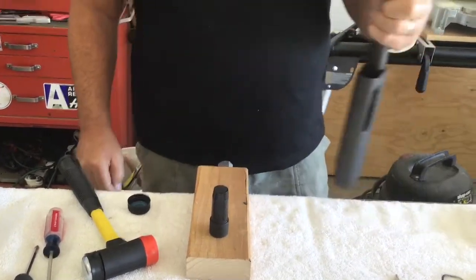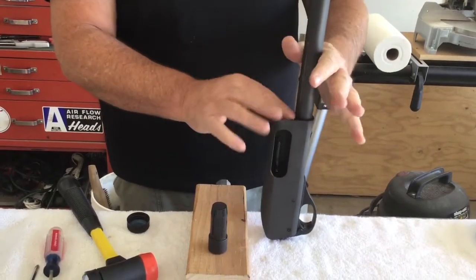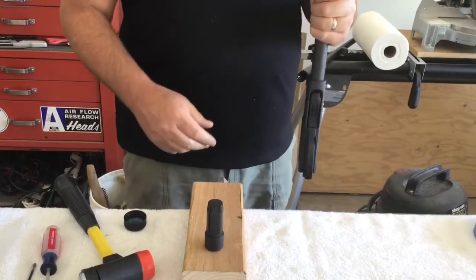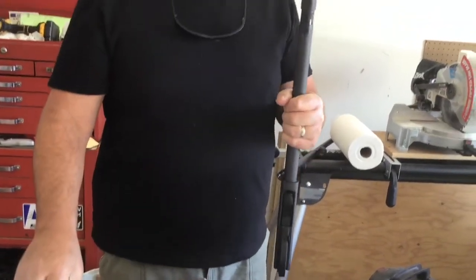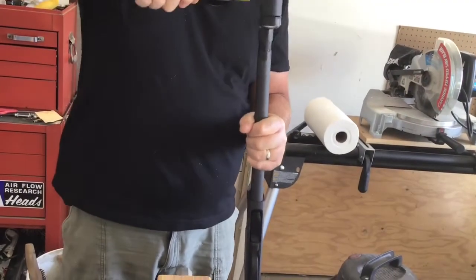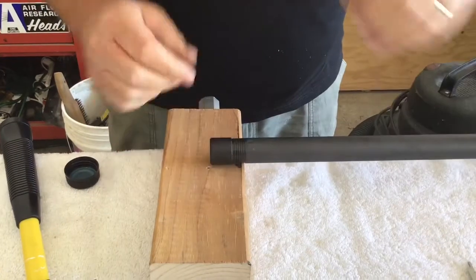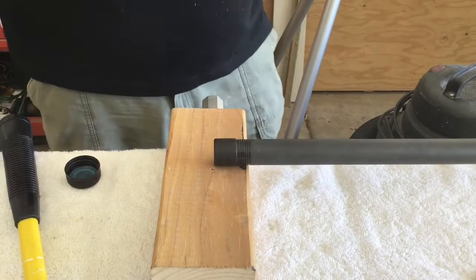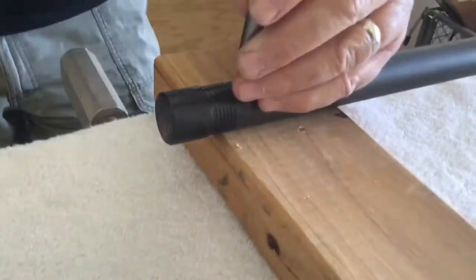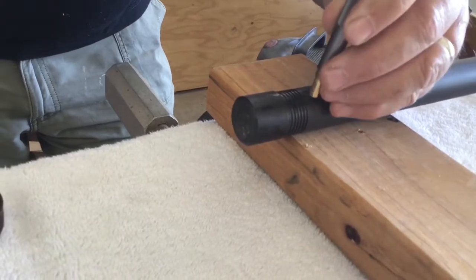When using this tool, I'm not going to place the butt end of the stock down on a hard surface and pound on it, risking dislodging the barrel the way Remington has it mounted. If we do that we've got ourselves a parts bin and not a foundation to build a tactical firearm with. So I'm going to hold the tube, place the tool in here, and tap it down by holding the magazine tube rather than putting it on a flat surface. Now we're going to work on these dimples a little bit from the outside — doing a little sheet metal work — and that's what's going to allow the swage tool to come out after we've worked on the metal with a soft punch. You can see how that's flattening up now.